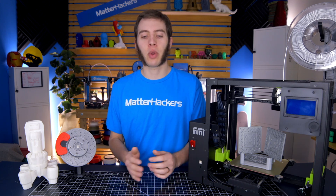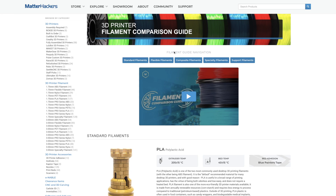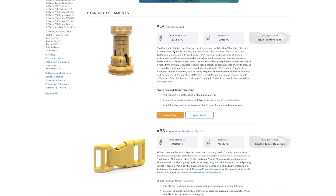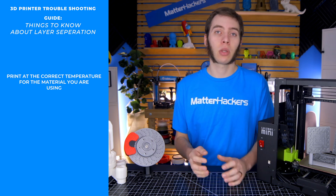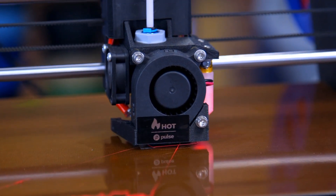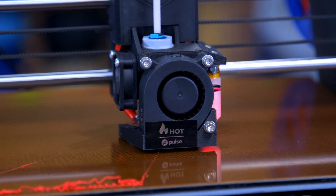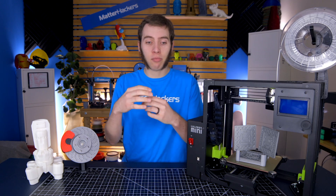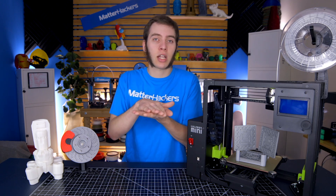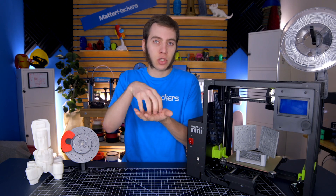The first cause might be that your printing temperature is too low. Every material has a specific range at which it might be printed — usually it's printed on the spool, sometimes it's not, and you can check the manufacturer's website. Some PLA likes to be printed at 180, other times you may need to go as high as 220. It depends on both the manufacturer and any additives in the material, or whether that specific color needs more heat to actually melt to the previous layer. That previous layer is already starting to cool by the time you're adding new material, so they don't actually melt and fuse together — instead you just have two separate objects delicately stacked on top of each other. As the part progresses, it starts to cool and lifts away.